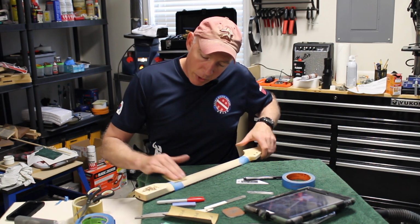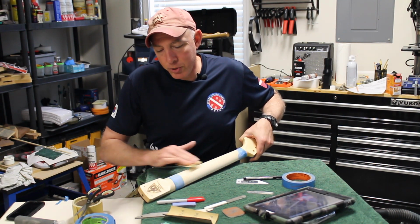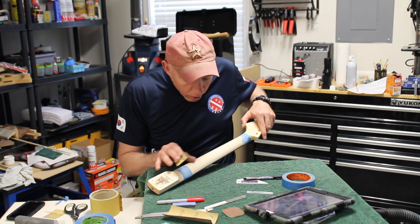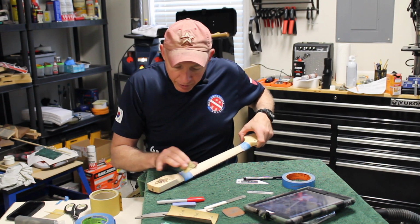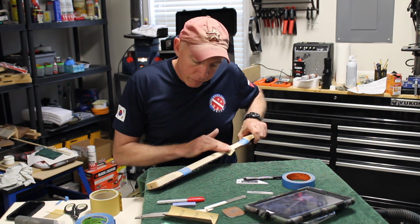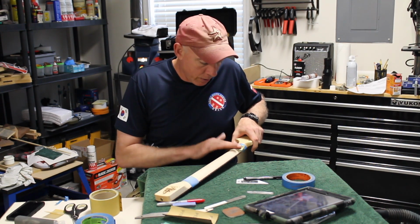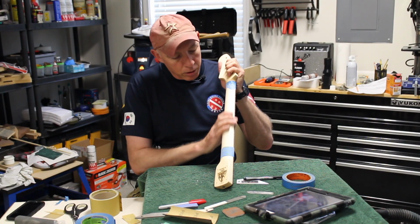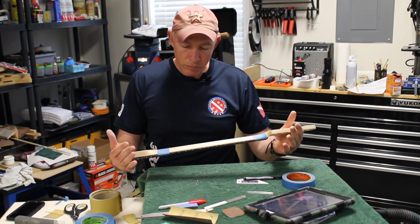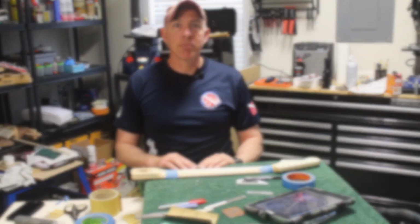So I don't know if this way is going to work or not, but it's part of what I'm trying out. This isn't so much of a how-to video series as much as it is a hey, see what I do and let's see if it works. Still very smooth, as you would expect, since I'm using 600 here. So even if I've gotten through the sealer and I'm in bare wood, I'm still quite smooth. All right, that's it. I think I'm going to clean off this sawdust and get ready for the next step.